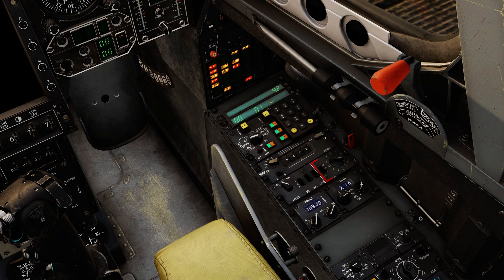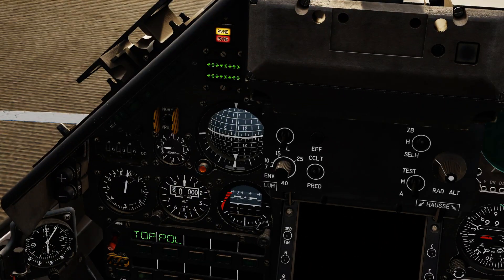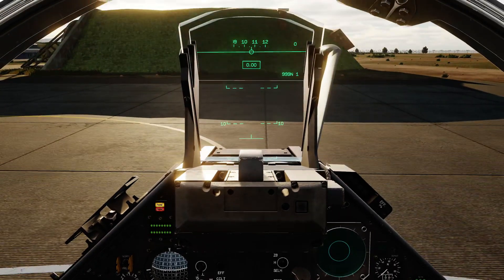We'll just watch this a little bit longer. This is basically the whole procedure. Once this is at 0 and I have a flashing pret, the last thing I do is put this into NAV mode and then we're good to go. In many situations, this is going to be what you're going to do. Of course, if you've already flown the aircraft or it's been moved, this won't work. At 0, flashing pret, confirmation that we're in stage 4. NAV mode, back to normal, and then we can confirm — artificial horizon flag is gone, and heading is correct.